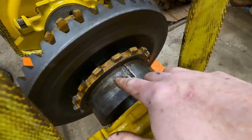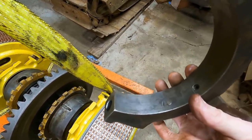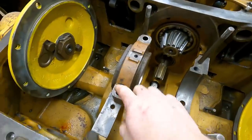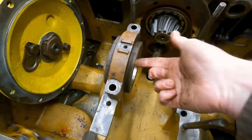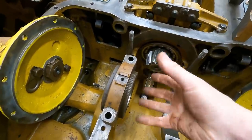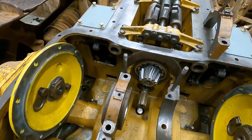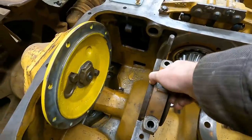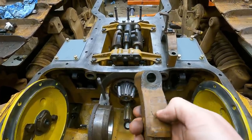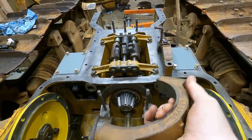So I can see what happened here. You see that notch right there? That is from this getting smashed in there or worn down. I think what was happening — this is the nut for adjusting — they had that nut on there and were using a hammer and chisel to tighten or loosen. One hit too hard, this wasn't tight enough, and it spun it just a little bit, then they tightened it down and locked it in right there. It looks like this was just drilled and welded, so I'm wondering if I can just grind this weld off and replace it. I don't want to order a new one — it's going to take a few days and I'm kind of getting a hundred-dollar-billed to death on this thing right now.